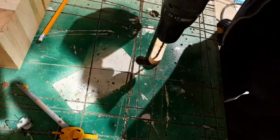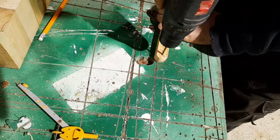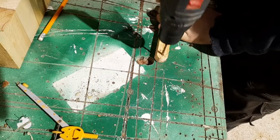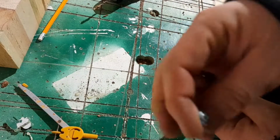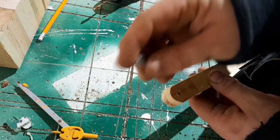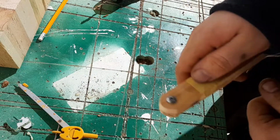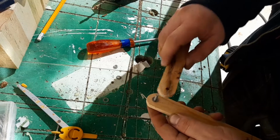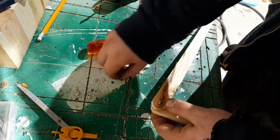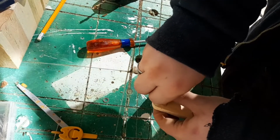So I still have these taped together because the last step we're going to do here is drill our pivot hole. So I've eyeballed this at roughly the center of that curve. And for my pivot, I'm just going to use these machine bolts that have a nice flat face, which means that they'll tighten and cinch well. And in coordination with that then I'll also use a few washers to give me both movement in between them and a clamp down on the outside.